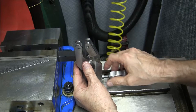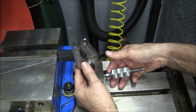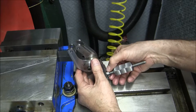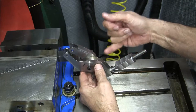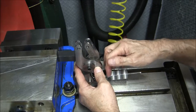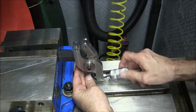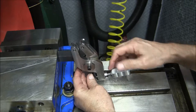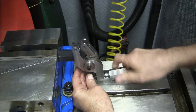You can see the 82-degree angle thrust washer fits down into the 82-degree angle scissor knurl arm, and the 82-degree angle I cut on the nut - with a flat the same diameter as the thrust washer - makes the nut and the thrust washer mate up really well.